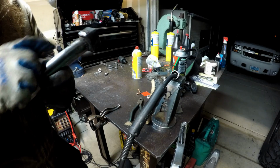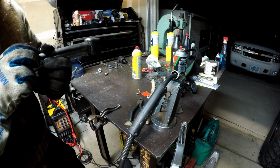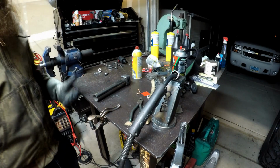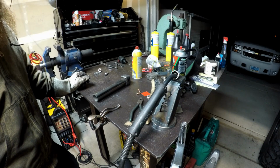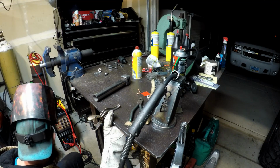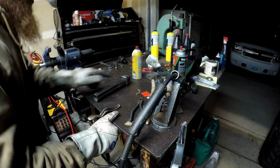Well, it is undercutty on this weld, but I watched the puddle wet really well on that surface, and it's also quite smooth. I think I've got my setting where I'm wanting to try this. It's filling in extremely fast, though. I'm feeling uneasy about how fast that is. Let's do 3 and 60, and I'm gonna do one more right here.